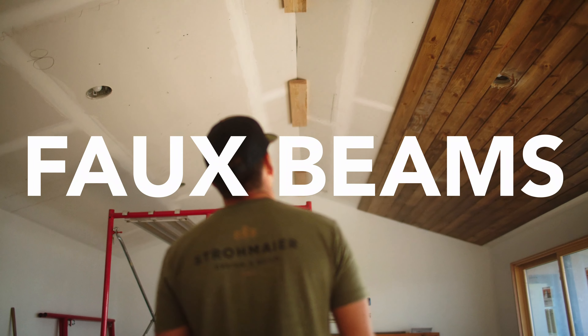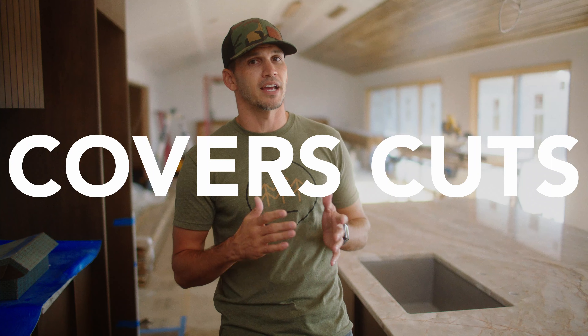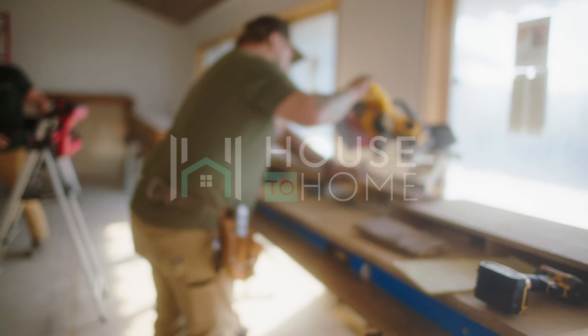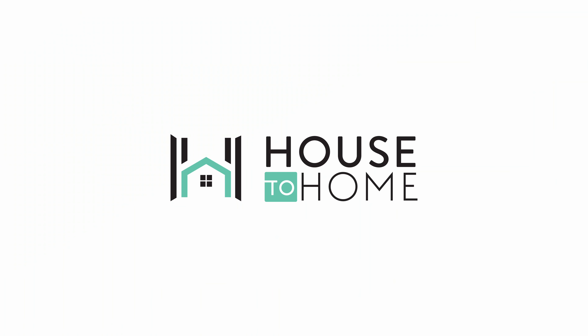Third thing is install. When you plan your layout and have all your studs marked, you want to make sure to use a crown stapler that is long enough to go through the wood, the drywall, and into the rafters. What we're doing on this job, we are actually doing faux beams — a faux ridge beam and faux beams that go down the edge — and that covers every cut so when you're done the whole job looks seamless.